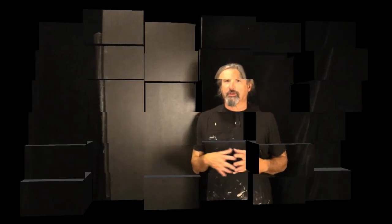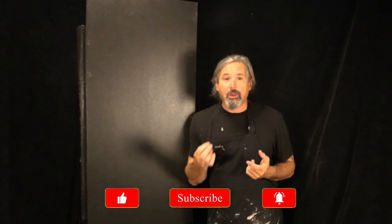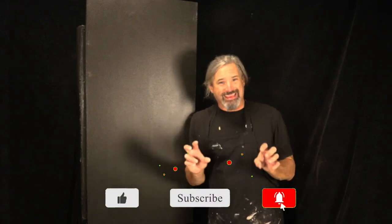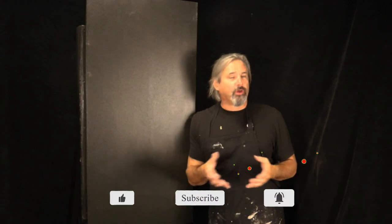So the first thing I've done to get ready for today's technique is I base coated the surface using the quartz primer. Quartz primer is an interior-exterior proprietary base coat. I know it's called primer, but it's technically a base coat. It is not used to prime raw surfaces. You want to prime those raw surfaces with the correct primer based on the surface.